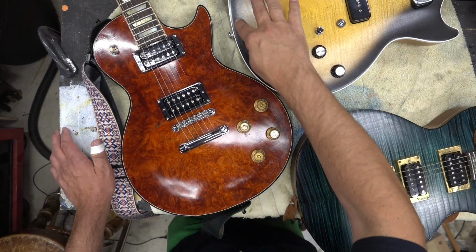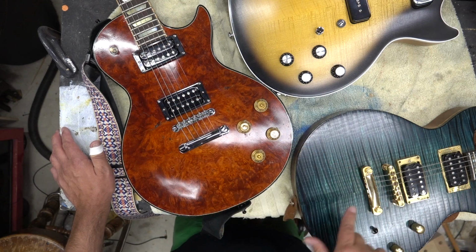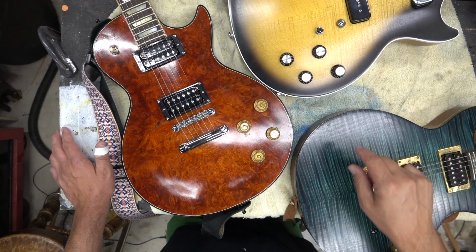The hand rubbing of the dyes, you don't have as much control with them in terms of getting this hard, tight line. You're going to kind of get it to fade back and forth. I did that on this one, and I did that on this one. You just can't get that hard, dark line like this. When you're spraying around, you can get a much more consistent line and sort of better fade, so better burst to some degree.